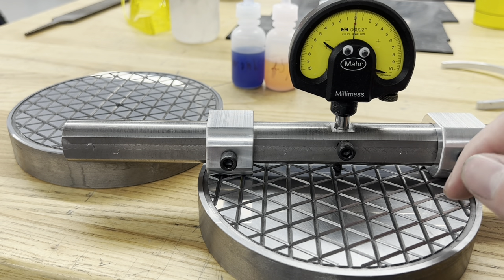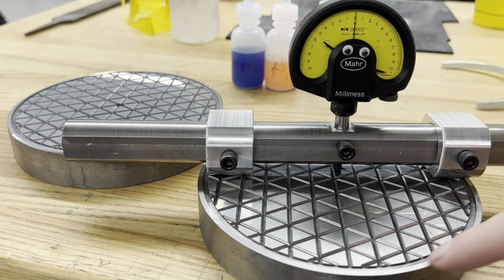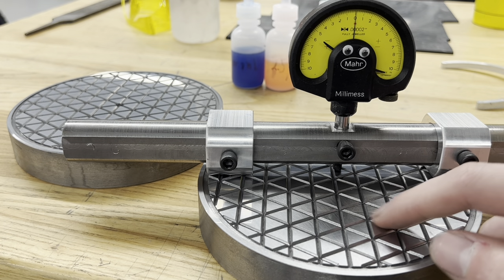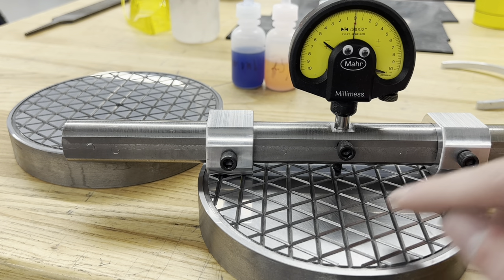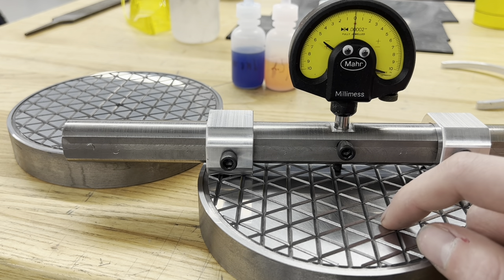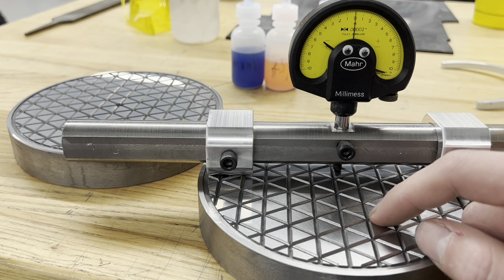The design was slightly inspired by Spencer Webb's most recent plates in that they have the annular groove along the outside to help contain the slurry — Robin, I think, was the original source of that idea and told Spencer to do it for his plates. And then for the groove pattern, we actually have a little triangular pattern instead of just squares. The idea being that the triangles can sort of wedge themselves through a hydrodynamic layer and break that up a bit better — inspired by the lapping plates that Philip made on Instagram, Steelfull or whatever his username is.